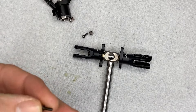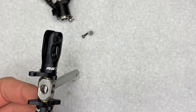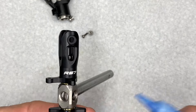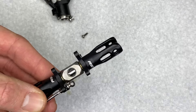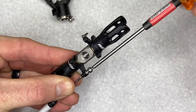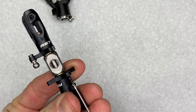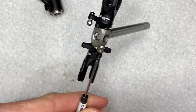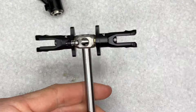Come back with a 1.5mm and a 2mm driver. Slide through the outside, put a little Loctite on the threads, get the ball end started, then use the 2mm driver to tighten it down. Do the exact same on the other grip — come in from the outside, slide it in, get the ball end started by hand, 2mm driver to tighten. The tail is almost complete.